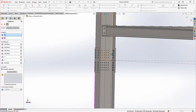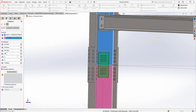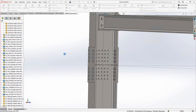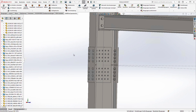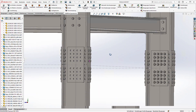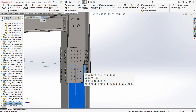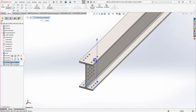We will add the bolting later with the manual bolting function. The second plate is added to the back in exactly the same way. You may wonder if the holes have been added twice into the beam — of course this does not happen. The software uses the extrude cut function for this, and Solid Steel recognizes that the holes are already present. We can take a detailed look at the beam: we see our bore pattern, and in the feature tree the entries are only present once.